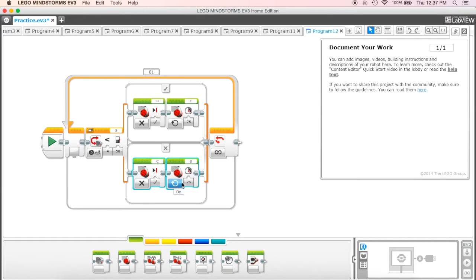Once it goes back to the edge of the circle and finds that dark circle again, it makes the condition true and turns back to the left. So it's going to constantly go left to right, left to right, continuously looking for the edge where it transitions between the yellow and the black of the circle. Since it's in a loop, it will just continuously do that, allowing it to follow the line and constantly look for those edges.